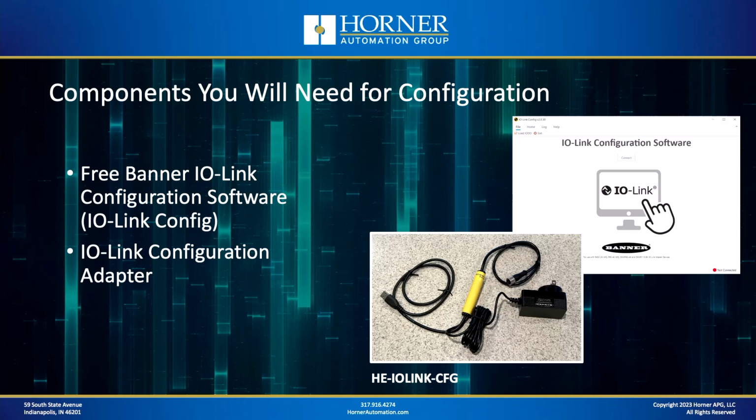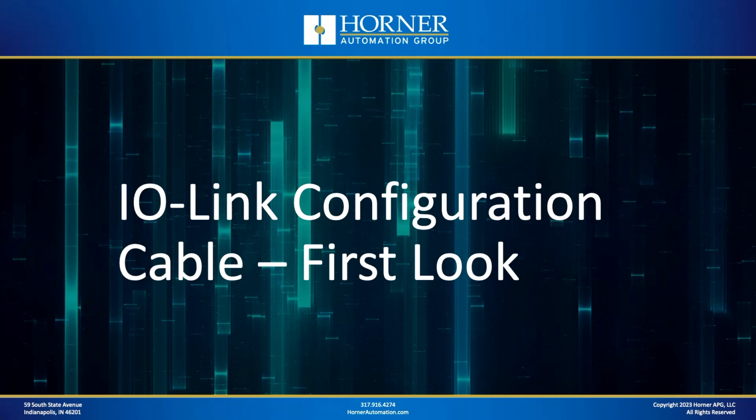And then there's another piece of hardware you'll need for configuration purposes, and that is an IO-Link configuration adapter, which effectively allows your computer via USB to connect to the IO-Link master, provide power to it during the configuration process, and configure not only the master, but also the IO-Link sensors and actuators that are connected to the master. Let's take our first look at the IO-Link configuration cable.